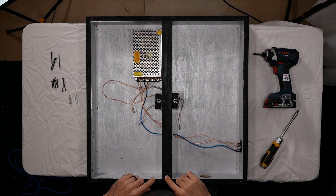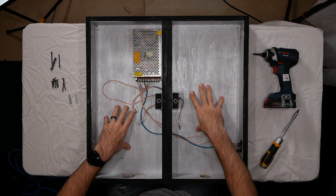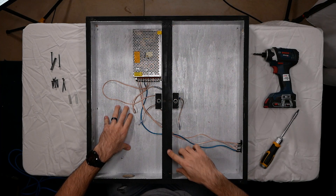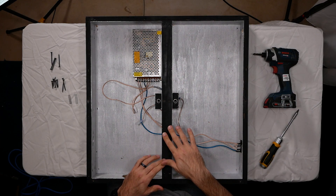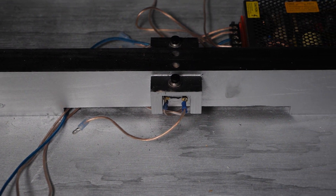To make the box, I use 3/4-inch plywood for all the sides and 1/2-inch plywood for the bottom. You might notice two giant holes in the side — that's for the fog, we'll get to that in the next video. The center support I made out of a piece of scrap basswood, but really you could just use a two by four, cut it down, and you should be fine. Not only does it support the plexiglass panels, but it also holds the mounts for the switches, which are used to switch on the lights.